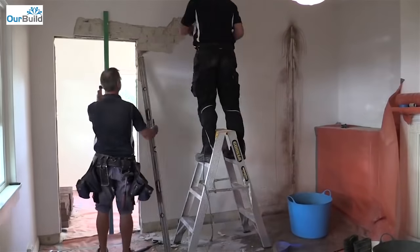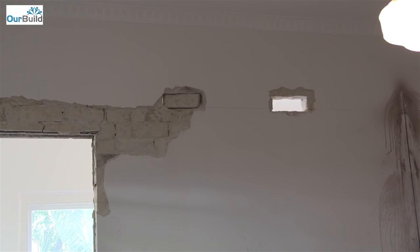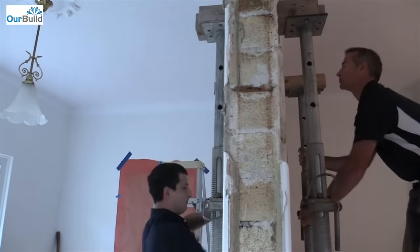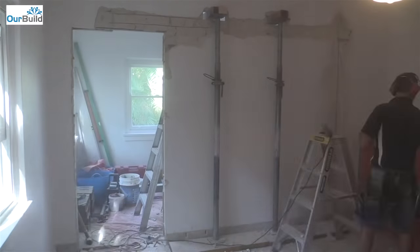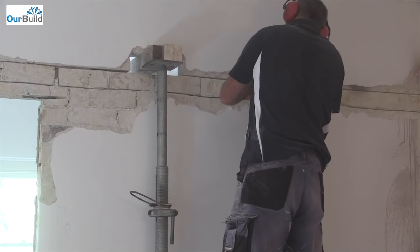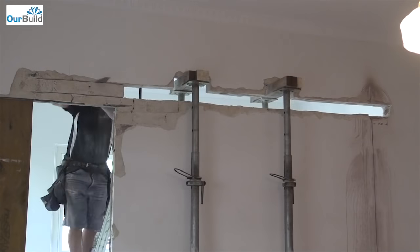Once it's marked out and you know where the height of the lintel is going to be, we take out a brick above the top of that — we mark out two bricks, space them evenly, and then put needles through. Once the needles are through, we can go ahead and take out a course of bricks where the lintel is going to sit. We do that by using an old hand saw or a grinder to grind out the old mortar joints. We're lucky here because it's old lime mortar, which is quite soft and easy to remove, but you do need to be careful not to bash too hard in this first course as it's quite delicate until you get the lintel in.